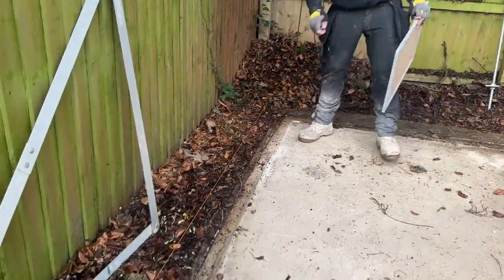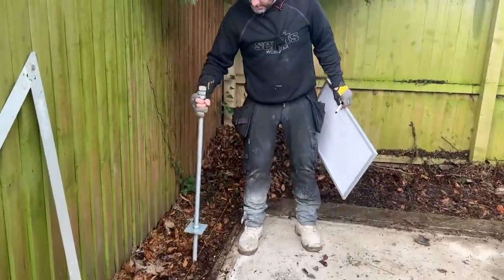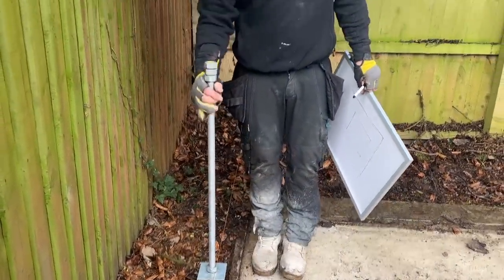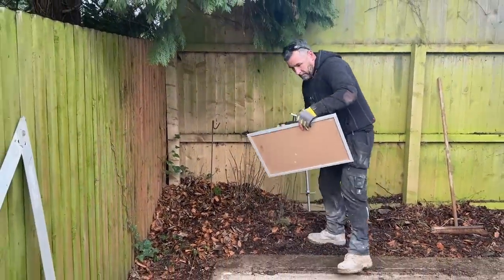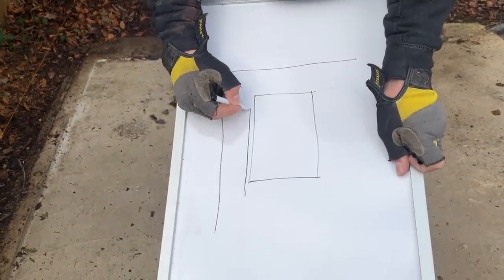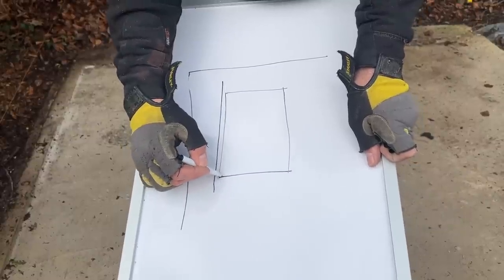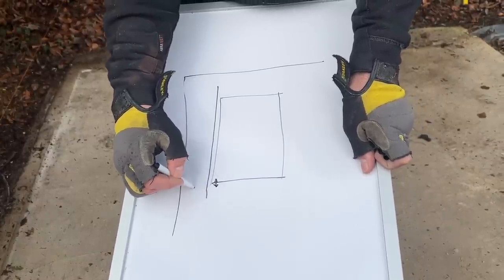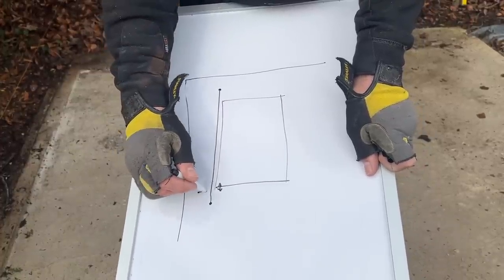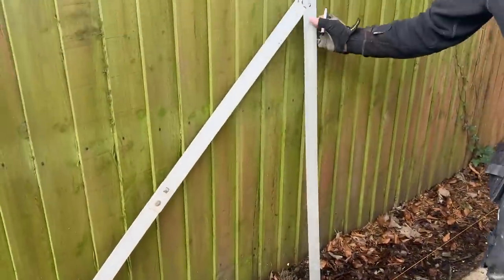What we've done is come 50mm off that pad. We want the rod to sit down in that line there, just offset off there. So we've pulled that line there like that — I'll show you about the lines and pins in a minute. We've obviously taken the concrete off there and measured 200mm off that pad, and we've also put a pin there. So what John will do now is pull a line along there and use his foldable square.